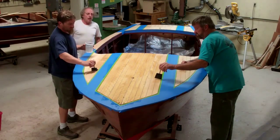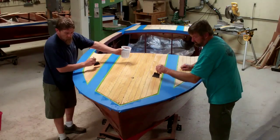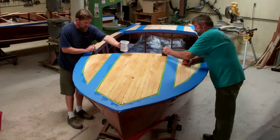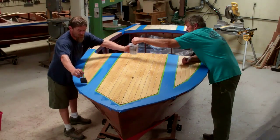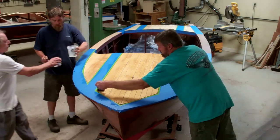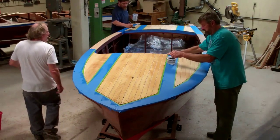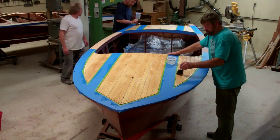Yes, as per the bleach, when you put it on, always coat evenly. So this water soaking in is basically going to open the pores of the wood up to allow the bleach to get in and do the chemical reaction that bleach does and pull the color out. The aft deck and the fore deck, we're going to bleach it all at the same time.